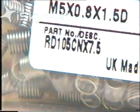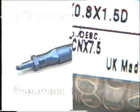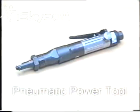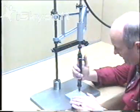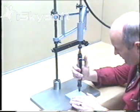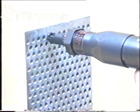It is essential, when using electric power tools, to ask for RD, reduced diameter inserts. Pneumatic power tools are air operated and can be used with free running and screw lock inserts. This tool uses the pre-winder principle for installing the inserts. It can be set up in a cantilever arm arrangement for more accurate positioning or hand held for greater flexibility.